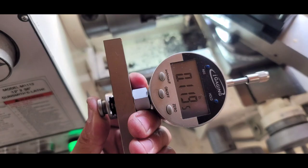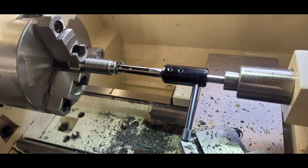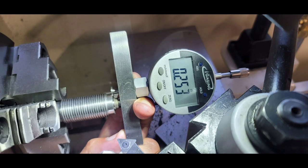To get the total chamber depth, first get the shell holder you plan on using — I highly recommend dedicating that shell holder to the die you're making. Get the depth of the shell holder, then add that number to the case head protrusion of your barrel. It's recommended to use a go gauge instead of a fired case; I'm just doing this for demonstration. Chambering the sizing die is just like chambering a rifle barrel. I'm using the Bald Eagle free-floating reamer holder and I ream about 150 thousandths per pass, then as I approach chamber depth I go to 50 thousandths, then 20, then 10, then 5, creeping up to the measurement I need.